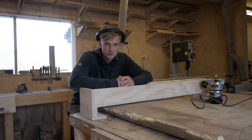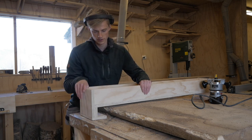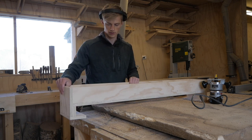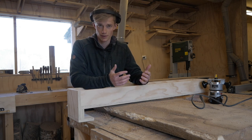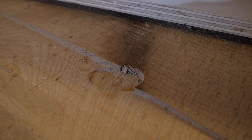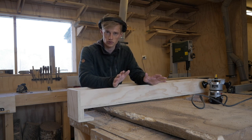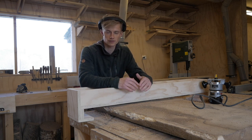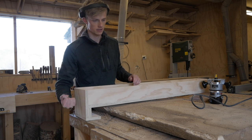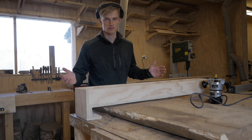Okay, so big rookie mistake here. I had this jig way too close to the edge and of course it slipped down — the router bit got deeper and made a mark. You were probably just sitting there waiting for that to happen. It's not a big deal, it didn't go very deep, and I was planning on doing two rounds anyways. Just showing you everything here, being transparent, showing you the mistakes that I made so that hopefully you don't do the same. Just move the jig and the whole slab in a little bit from the edge.